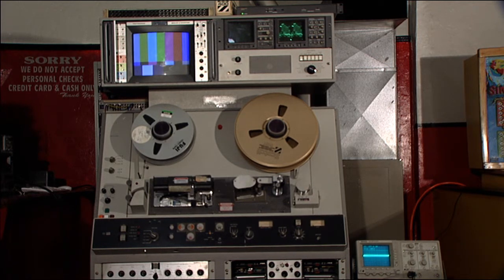It is on, and currently it's unable to play tape because I have to do some troubleshooting on the vacuum system so that the guide works. Without the vacuum guide working, you don't want to run the VTR because it will significantly shorten the life of not only the heads but also the tape. The heads are the most important thing whose life is being shortened because they are being refurbished, but they're very expensive. There is one place that still does it — they're taking their last orders, and it's $6,000 for a set of heads to be refurbished.